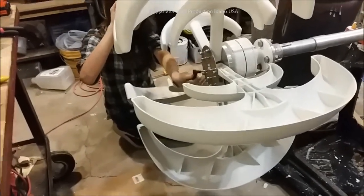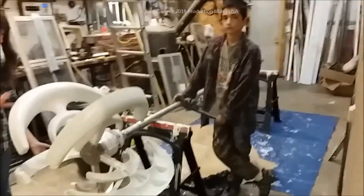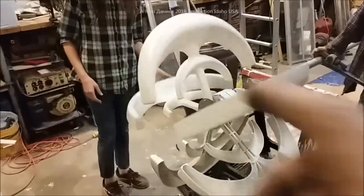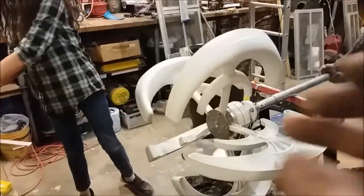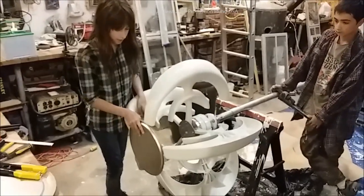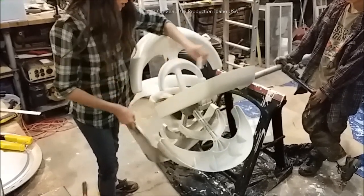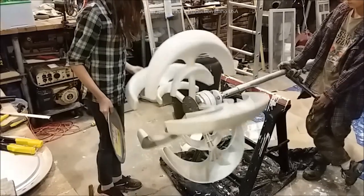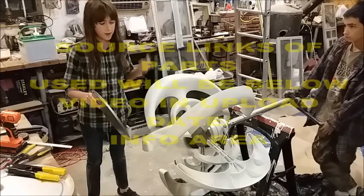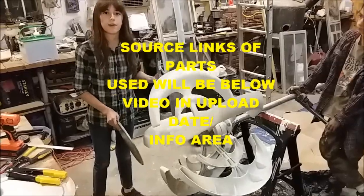The rest of it is just standard assembly like they show you in the paperwork, but be careful doing it. Don't use power tools if you don't have to on this — not a good idea, it might cause you more problems than you're willing to deal with. Daniel is helping his sister finish this thing and she found a small problem — I'm going to let her explain because it's her turbine. She figured out to put this pizza pan right here, this aluminum backer with three rivets in each plate, so that the blades won't wiggle and we'll be able to produce the power we're working for. Like and subscribe, comment if you want, and be watching for the next video when we mount this up high.